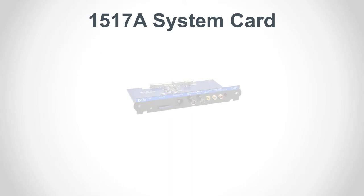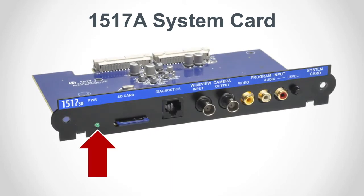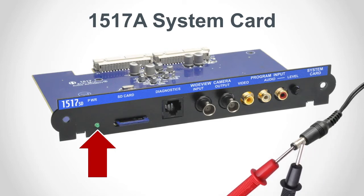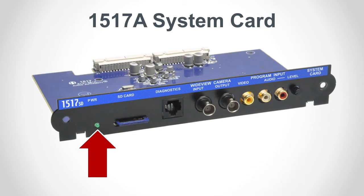The power LED indicates the power supply is plugged in and the hub is receiving power. Normal LED behavior is a flashing pattern — long on and short off. If the LED is dark, there is probably no power to the hub. Check the voltage at the plug end of the power supply. If it reads 12 volts, then there is a problem with the system card or somewhere deeper in the hub. If one of the other cards has been damaged, it might cause a drain on the entire system and keep the system card from functioning properly. In either case, contact Audio Authority Support for further troubleshooting.